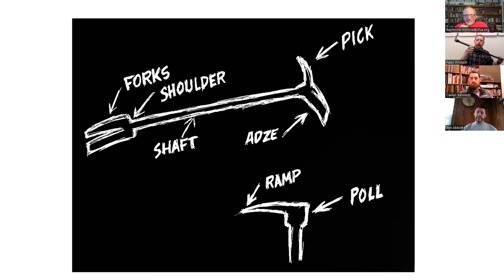I've got one here with me. So you have the adze. The basics of mechanical advantage: you have a two-inch wide adze, it's a class one lever, 30-inch long shaft. Mostly what we're using this for is inward swinging doors — we can leverage them open — or outward swinging doors, we can get around the door and then pry back, breaking the lock.